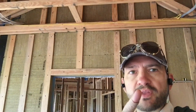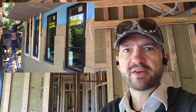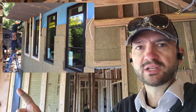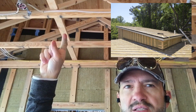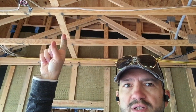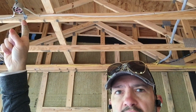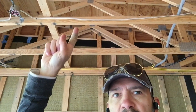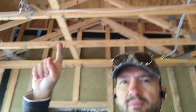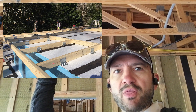The insulation on the home is 4 inches on the walls and 7 inches on the roof, so our flashing here is 4 inches wide and 7 inches up here. In this 7-inch section, that's where our outriggers come and they support the garage wall that carries the roof load. We also have some clips that we've used to attach these outriggers to the sheathing of the home.